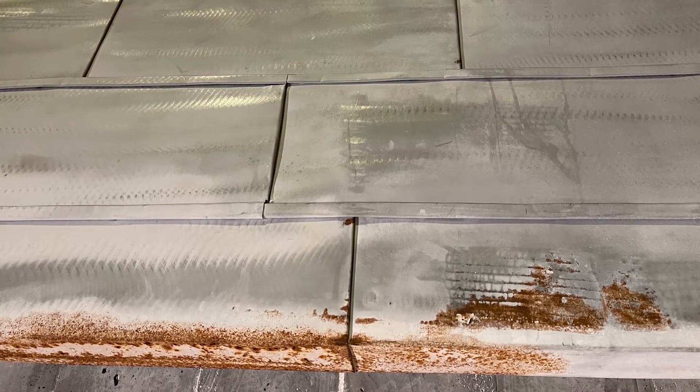Do not use galvanized steel for food surfaces. This is a big no-no. It can and will rust over time and it will release small nasty particles that could contaminate your food and cause big problems. Don't do it. I've seen all sorts of instructions on the internet over the years and it makes me cringe every time. Decorative elements are fine, but not for tops. Do not do this.